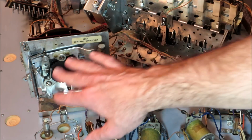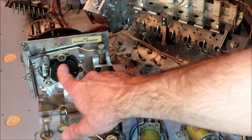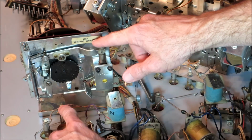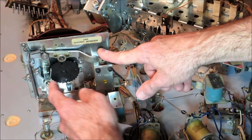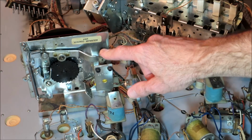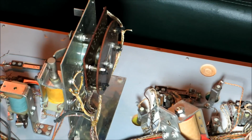Now this thing is not lubed up and clean and functioning super smoothly, but it is functioning. And you can see there's a gear here. As the coil activates, this arm comes up, and this little lever here grabs a tooth and pushes it down. And through the use of these springs, when the coil goes down, springs bring it back. It just keeps rotating this wheel. Now let's look on the other side of the stepper unit to see what's happening over there.